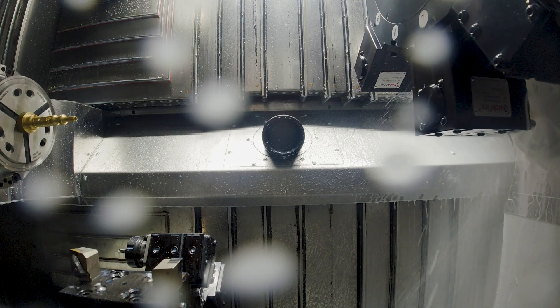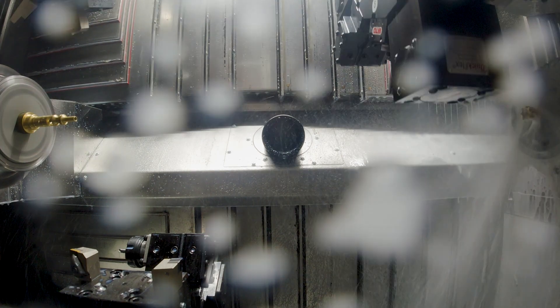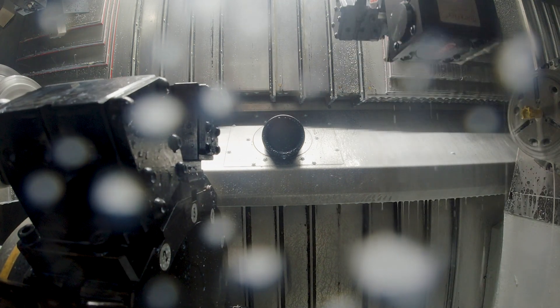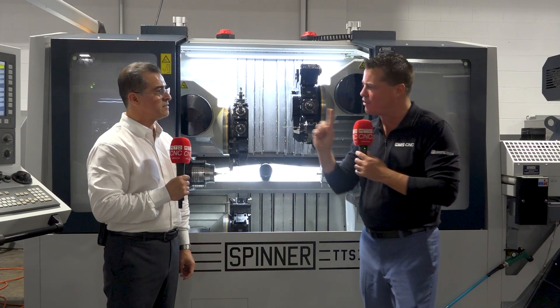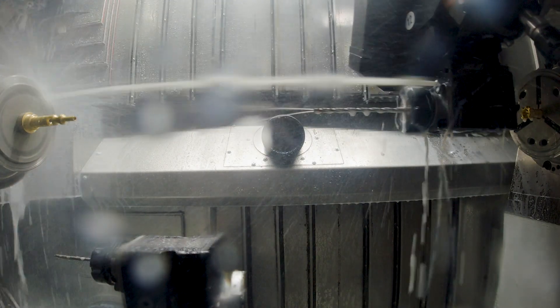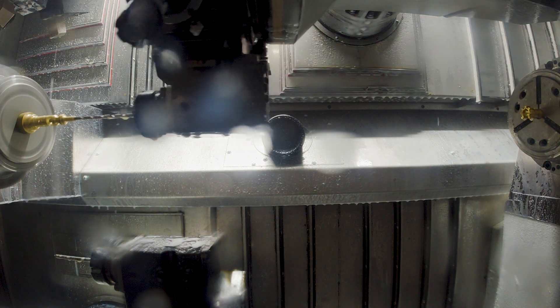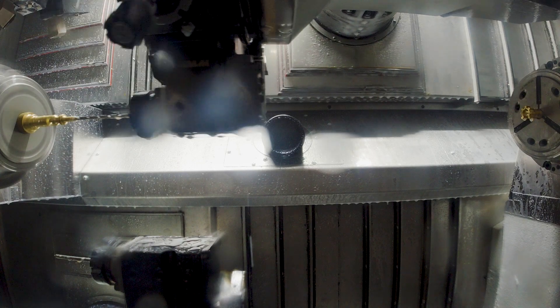The possibilities are endless, and you are a legend in the industry. You've been doing this a long time. You've already mentioned pinch turning — can we dive into the concept of pinch turning just on op 10, because obviously op 20 can be running on its own also? There are two kinds of pinch turning. One is doing roughing and finishing at the same time, where one tool is trailing the other. The other is roughing with both tools at the same time, and you can support the part — even a long part — because you're compensating for the pressure of one with the other cutting at the same time. That is what allows you to do longer parts and be more efficient than the competitor.